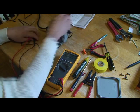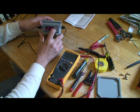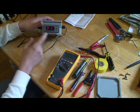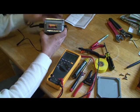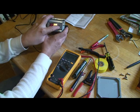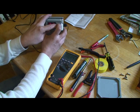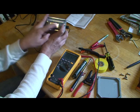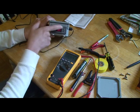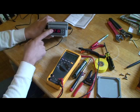There's some voltage leakage onto the cold side but it's only showing 3 volts — that isn't going to be enough to do anything. To change the temperature, hold the S button to get into program mode. If you want to go through the different options, hit the up arrow — F2, F3, F4, F1. Hold down S, change the number lower so it calls for cooling, then hit the power button to confirm the change.